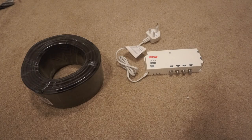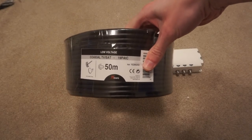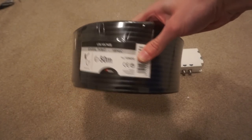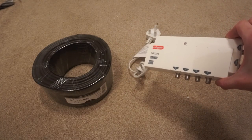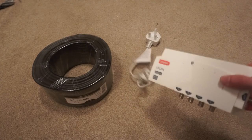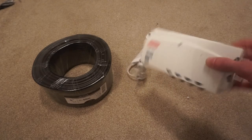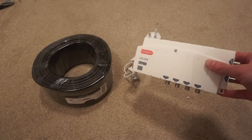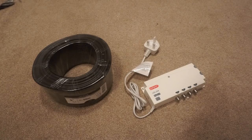It's now the next day and I've got a few more bits to install. I've gone out and bought some coax — about 50 metres of RG6. I'll be using this to run TV aerials. I also bought this distribution amplifier, which I'll be mounting in the hall cupboard next to the rack to amplify the TV signal to all the rooms. I think I'll be returning this one and getting a different one because it produces a really loud whining noise when in use. I'll have something similar mounted in the hall cupboard, and I'll just be running the coax alongside the Cat6 to certain points.